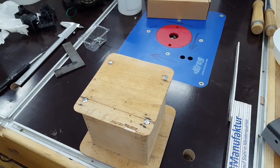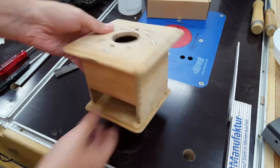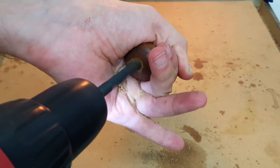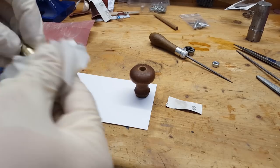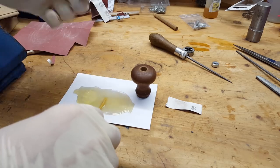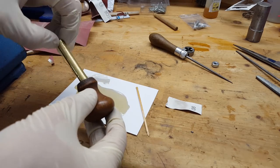The final two wooden parts that still had to be prepared for refinishing were the wooden knobs. Let's take a look at the crank knob. Originally, it was mounted with a rivet that it was spinning on. This had the disadvantage of wearing down the wood when grinding coffee, combined with an awful squeaking and making it impossible to take apart and clean without damaging something.